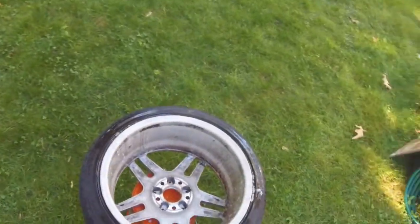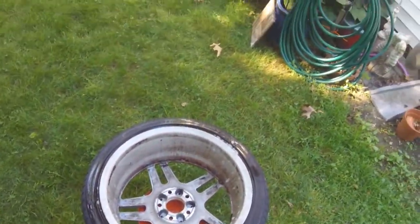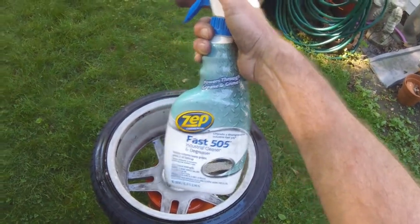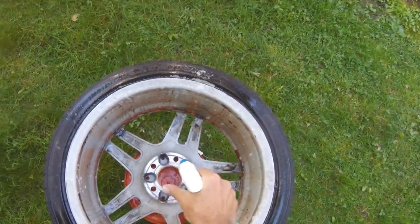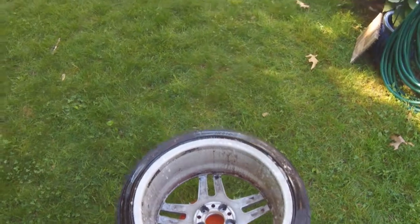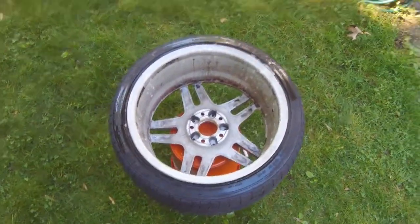Ground all the burrs off, so it's good enough. They're scratched up - do what you can. Got some ZEP here, just something that's going to get all the grease and oil off. Got to get the grease and oil off or your paint will fall back off. So we're going to clean this backside up, then flip it over and clean the other side. Then we'll go into the sanding.